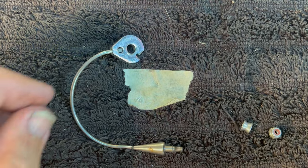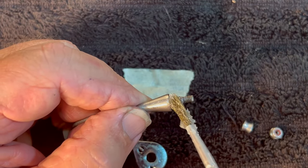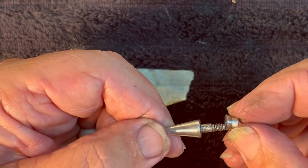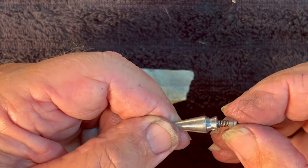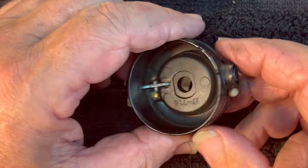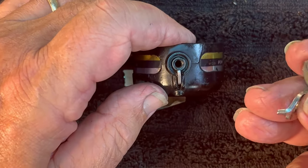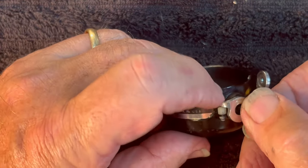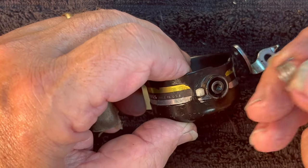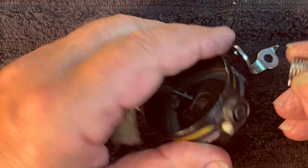I'm back now. The parts are clean and we're ready to start assembly. We're going to start off with this bale wire — we're just going to lubricate it and slightly assemble it, because we're not putting it on the arm yet. We'll put a little grease on it, slip the roller on, make sure it spins okay, set the nut on, and give it a little twist. Now let's come back to the rotor and see about getting it back together the way it belongs. The arm goes on this side over here. Remember, it's got this drop that comes down and hits on that bumper. This spring has got two tag ends — one sticks out, one sticks up.